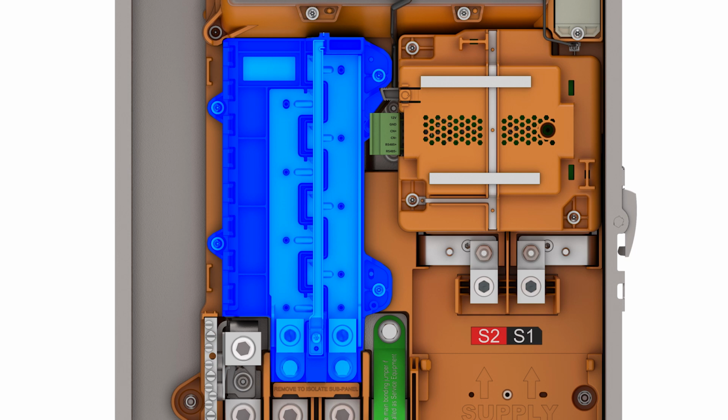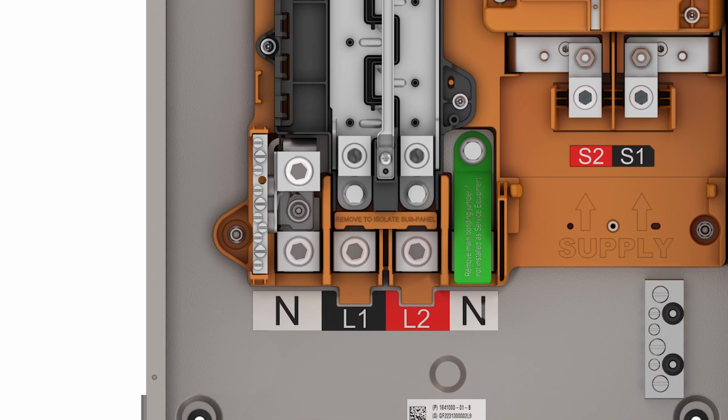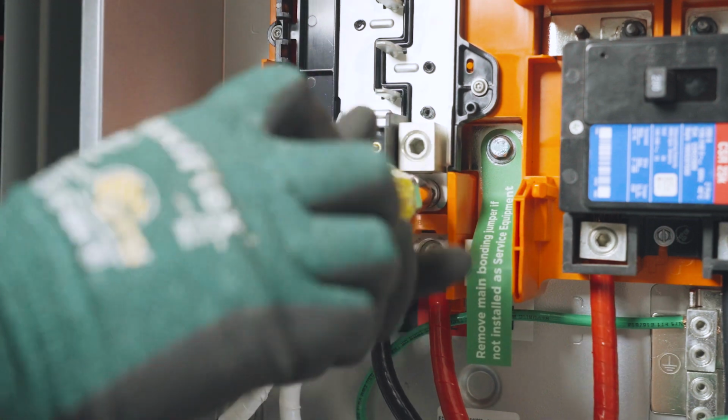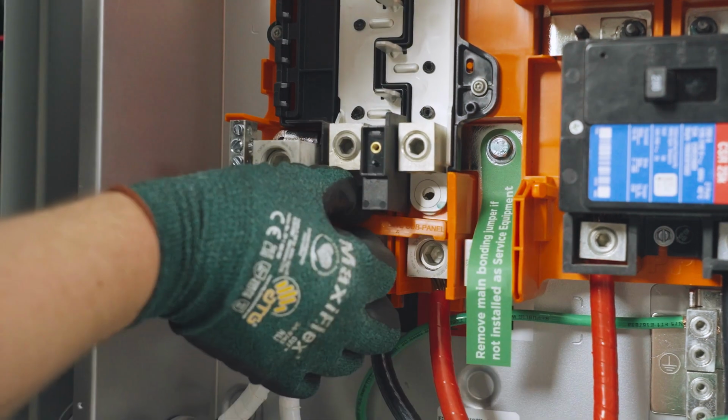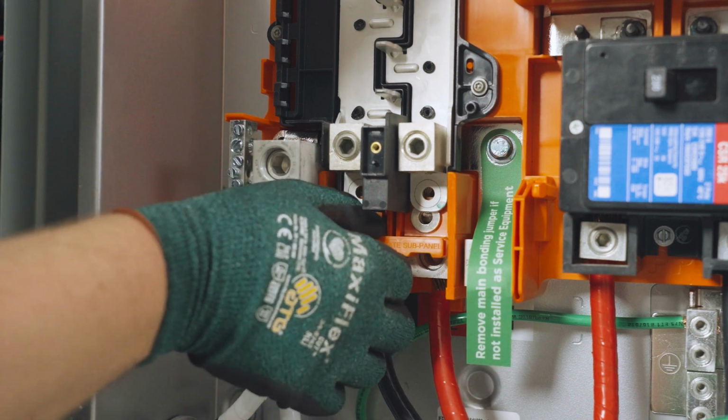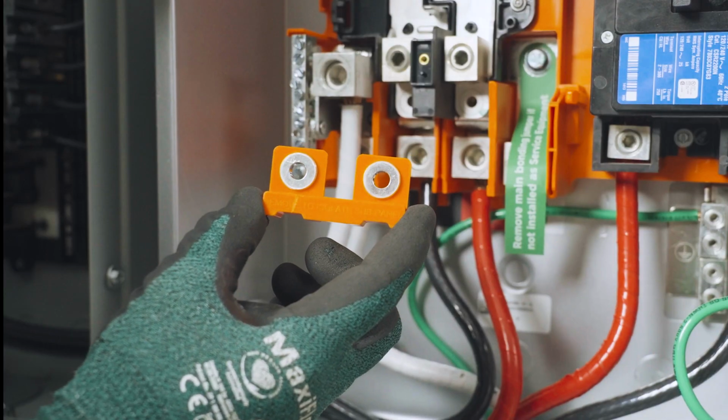The internal panel board is the preferred location for the breaker for wall connector. Inverter breakers can also be located in the internal panel board or any other panel that is in the backup circuit. Under the internal panel board's lugs, this jumper is factory installed, connecting the internal panel board busing to the backup busing. The jumper should only be removed to isolate the internal panel board from the backup lugs, typically when local code requires a line voltage disconnect before power generation breakers.